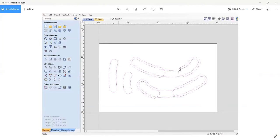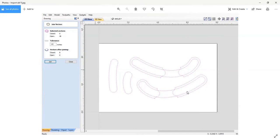And you can see that the pockets are actually a little bit oversized from the actual radius of the parts. That's so that the bit cuts all of that away and you don't have any weird leftovers at the edges that have to be sanded.